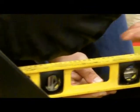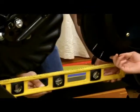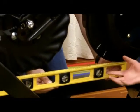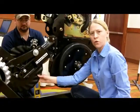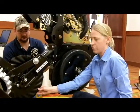What that tells us is that this no-till coulter is actually a quarter inch above the bottom of the double disc openers, which is what we'd like when we have this set for the field. Too often, we find that this no-till coulter is set too deep or too aggressive out in the field.